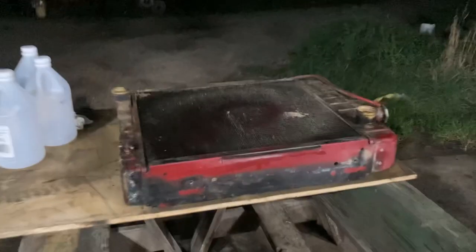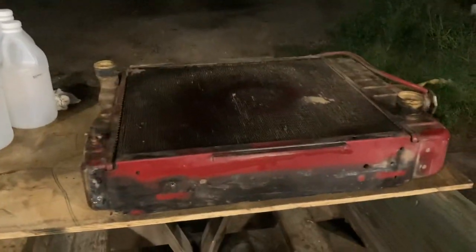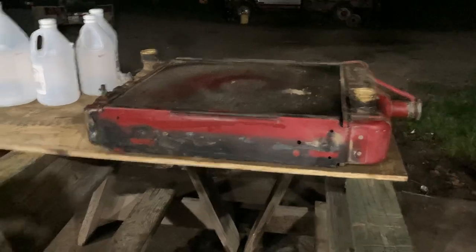It is getting better. Right now it is dark and we do have rain chances. My dad's been working on this radiator for us — it's an International 656. It was leaking, so he put some vinegar in it. Vinegar is an acid; it will eat away any gunk that's in there and determine if there are any more leaks. Went to town and got some metal brake lines — 20 inch and a 40 inch. I do need a rubber brake line, but Napa didn't have it, so he had to order it out of Omaha. That'll be here sometime next week, but until then I can just keep doing what I'm doing.